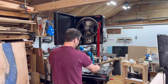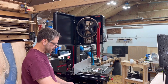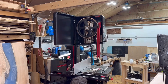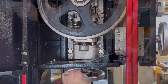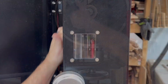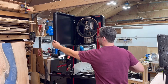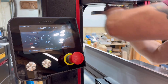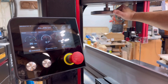I'm going to save the little tape that comes with the blade because I'm going to have to enter new information into the computer. This new blade is from Timberwolf. One of the cool things here is the dual tension that allows you to put more tension in. Once you release the brake, the wheel can turn. I love this little viewfinder. Tighten the tension bar back up. You can see I'm not at enough tension yet — if I turn it one way I'm loosening it, so I need to get to the right tension.